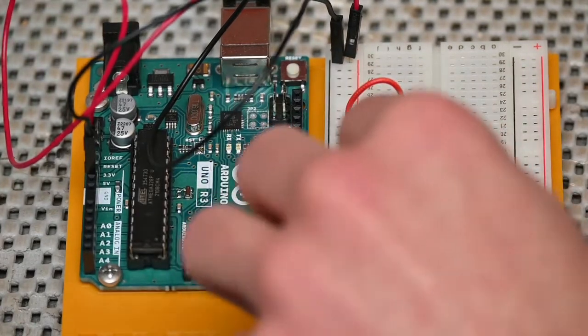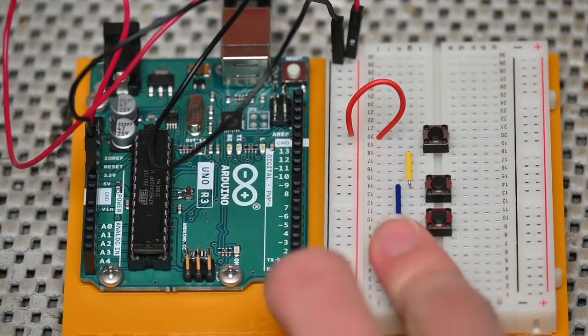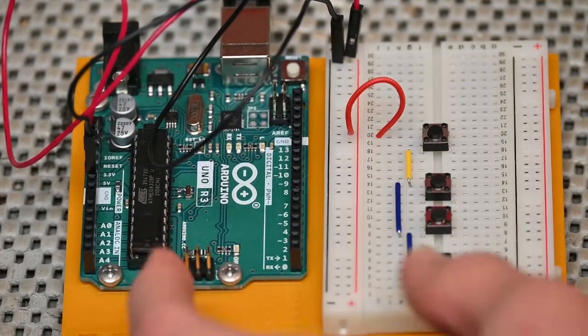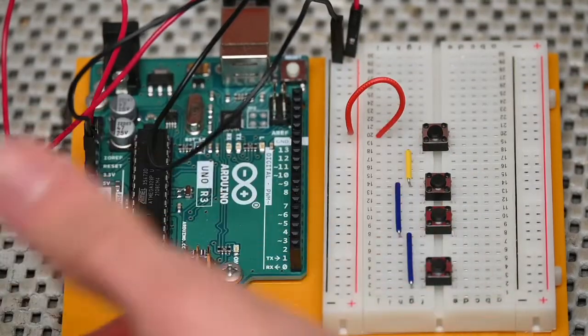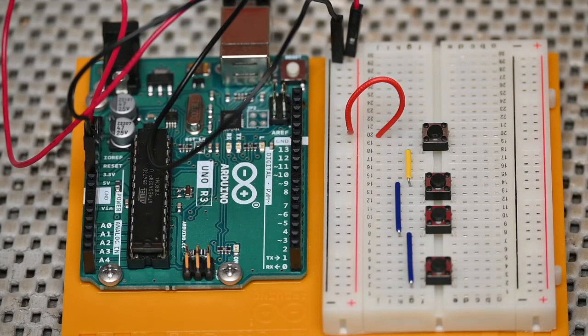When the voltage is converted to current, it gives you the ability to use an R-2R ladder. An R-2R ladder is a cheap way to create a digital to analog signal. It's an electrical circuit made from repeating units of resistors that act like current dividers. The basic R-2R resistor ladder usually has 2 resistors, a base called R, and then 2R, which is twice the value of the base. There's so much more that I could say about resistor ladders, but for our basic needs for this project, that's all we're going to need to know. But I do encourage you to do some of your own research to learn more.